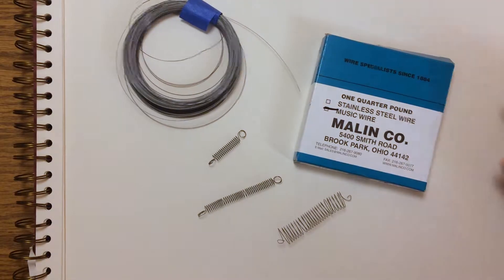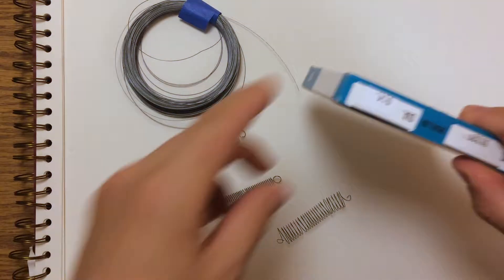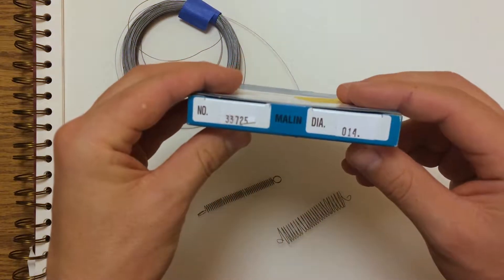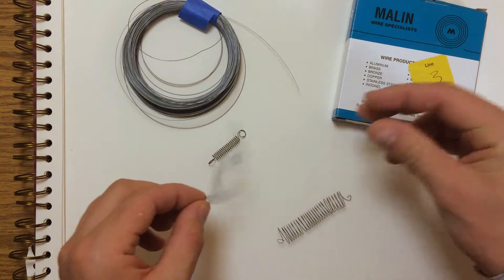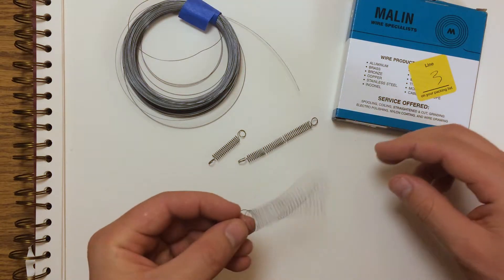So I've gone and done some investigation, and it looks doable. The ideal material for making springs is music wire. It makes sense — for a musical instrument such as a piano or a guitar, you want a metal that vibrates nicely. So I've got a few different wire sizes, and the first one I started with is a thickness of 14 thousandths of an inch. And I've had some success — I've made a few springs here. Check it out.